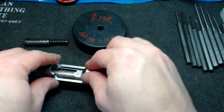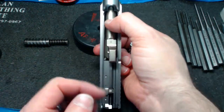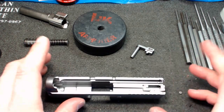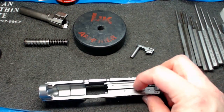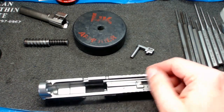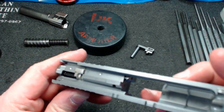So when they built this, if you look, when the barrel is in there, this whole thing is off to one side. Basically, this block is only half of what it would normally be. Again, just how they designed it gave more clearance for the rest of their parts, and they actually end up with an almost elegantly simple design on the frame. Either way, it does have a firing pin safety, so the firing pin cannot go all the way forward unless that's pressed. And when this is pressed, that firing pin is free floating, so it is inertial. In other words, the striker spring only takes you so far, and then inertia takes you the rest of the way. And let's see, what else was in here that I had to cope with for disassembly? Right.